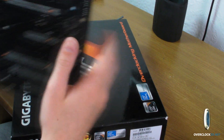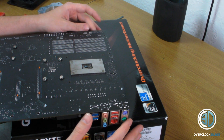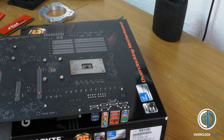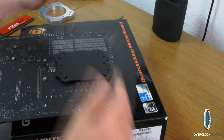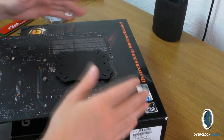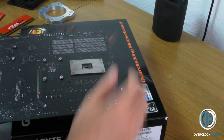Also what we're going to do — and it's where we're going to start — is put putty on the back of the board. I'm going to putty all around the back of the board, around the back of the DIMM slots, pretty much cover most of the back of the board with a thin layer of putty. Then what I'm going to do is put the back plate on and poke the rods through for the support of the pot — that's how we mount it. We're going to do the back first, get the back plate on, flip it over, mount the back plate properly, and then we'll be able to start putting all the putty around the other side.